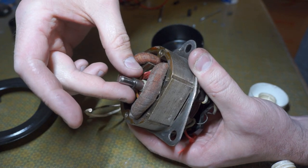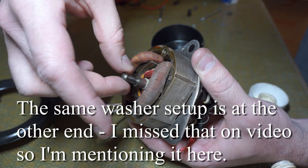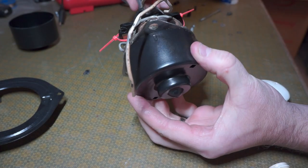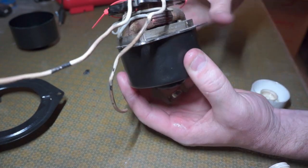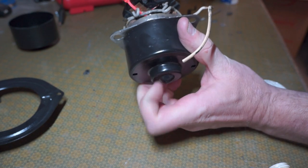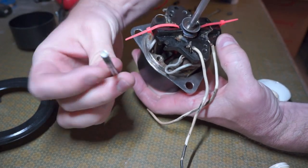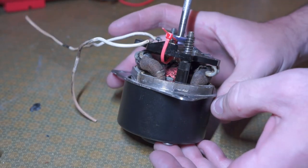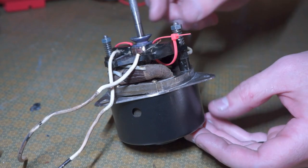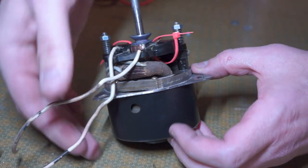Now I'm going to put the bottom cap cover on. There's a washer and then one of these spring washers — basically a bent washer — and that goes on, then the bottom cap goes on. When you get it back together, make sure the center shaft on the bottom is going through the bronze bushing at the bottom, centered in there. On the top, you'll want to line up the holes — these long bolts go through, then there's a black spacer and the spring goes on top. I've put a nut on top just to hold it all together while I feed through the wires.